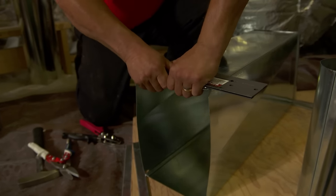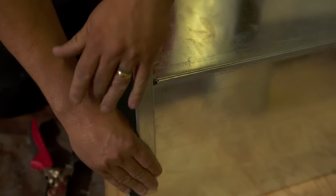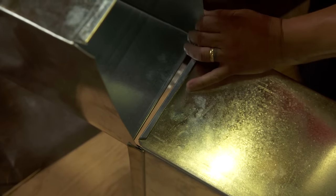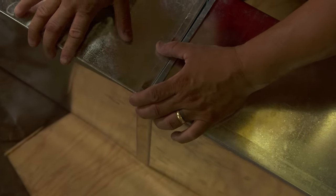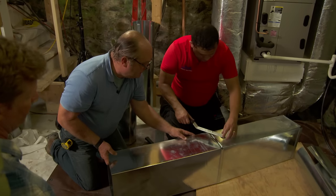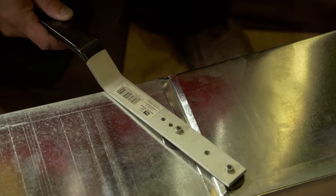And now he has to do the same thing on the direct opposite side. So in the unbent pieces of metal, next thing we install is an S-clip. You can see one on each side. And that's going to allow the male piece, the straight piece, from the next piece of ductwork to key right in to that S-clip. So sometimes these don't go in this well. So Obie, show the tool to just roll those together. It gives you a little leverage. If you had a long piece of duct, you wouldn't be able to get it in.